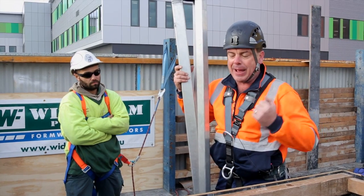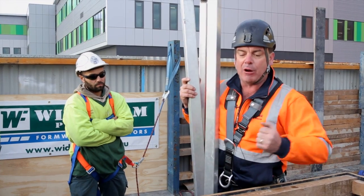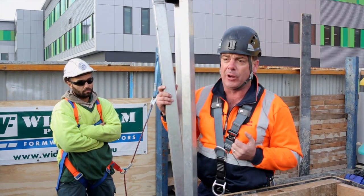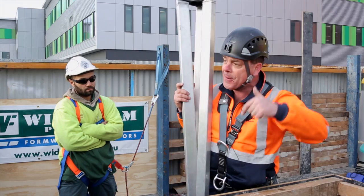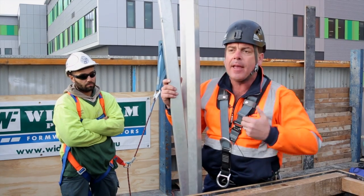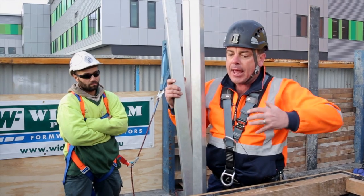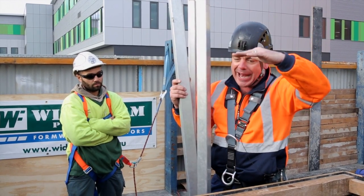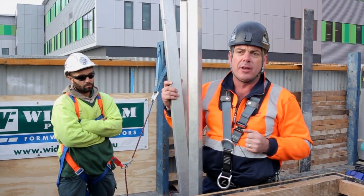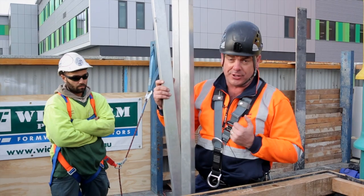You obviously need to maintain that. It is an advantage that we're going to have a clear opening to ground, but what we've also done is open up a big fall distance, haven't we? If we have all those doors open, we've got a big long drop to ground. So as we're lowering the casualty, people will be transferring to lower levels, etc., yeah? It makes sense that as that casualty is being lowered and they're approaching the next door, that's when you open the next door. So in a way, you're limiting the possibility of a fall distance, yeah?